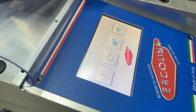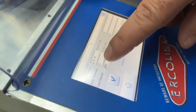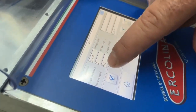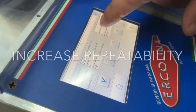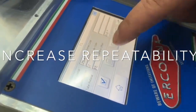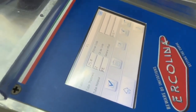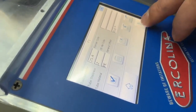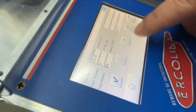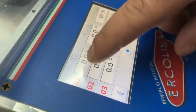Here we have the programming part of the page. In this case, we have a one-inch tube, two-millimeter wall thickness in steel. We can put our former code and counter bending die code in here if we wish, and set the offset if we programmed one because we're using the manual accessory. We can delete, save, and transfer programs, and then we'll begin our program.